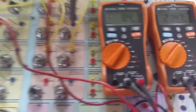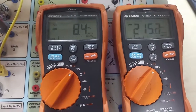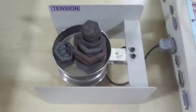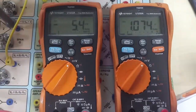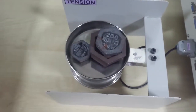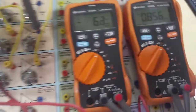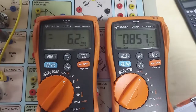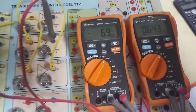For 200 grams, the instrumentation amplifier output is minus 8.4 and the amplified output voltage is 214.8 millivolts. For full load (1 kg) in the loading condition, we are getting 1.074 volts. Now unloading: removing 200 grams to 800 grams, we get 856 millivolts. For 600 grams while unloading, we got 643 millivolts.